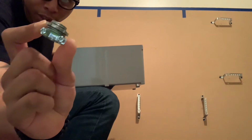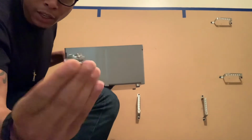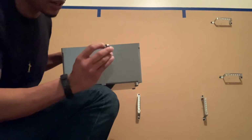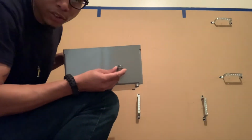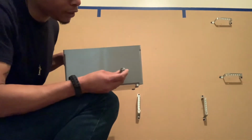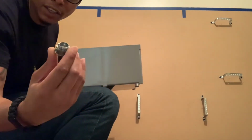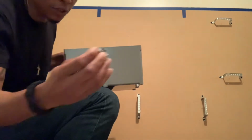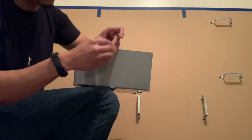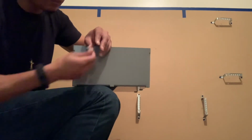Like these, I'm just using these simple 2-screw connectors. Some people call them 2-screw connectors, some people call them BX connectors. It's a different term for it. But these simple, basic ones right here, a lot of times it's good to use CGBs or the plastic watertight type of cable connectors if you're using a box like this. But just for instruction purposes, I wanted to use these because I had these on hand, and they're simple. Once you drill your holes, you just take the ring off, slide it in, tighten the ring down, and it's pretty much ready.